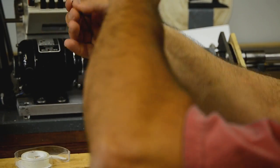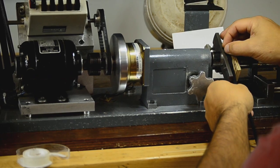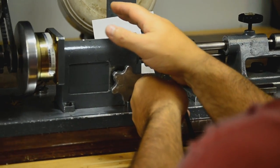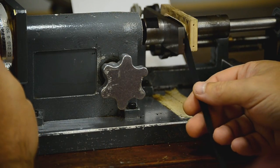I'll cover the coil in our 3M 260 tape. It's designed specifically for coil use — it won't corrode or interact with the wire or solder joints. I like to use two layers here.